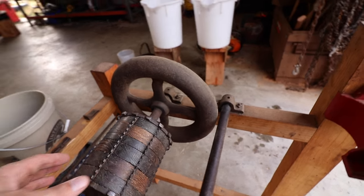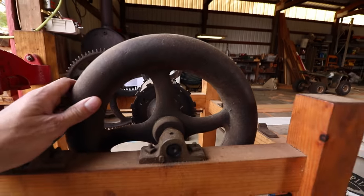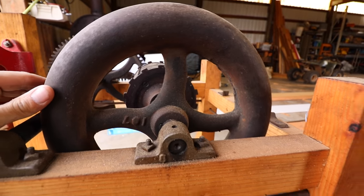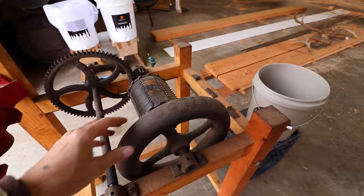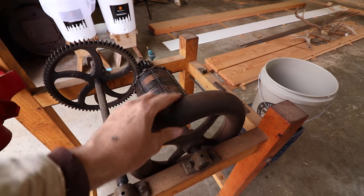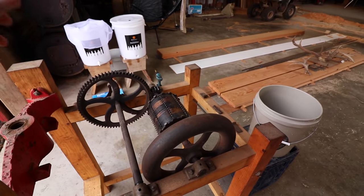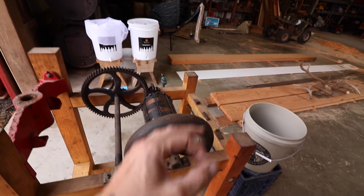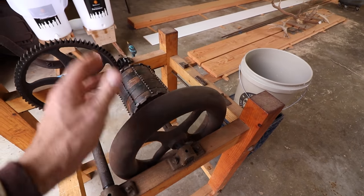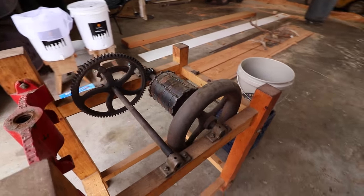One of the features that makes this really useful and easy to use is this heavy flywheel — and it is very heavy. The purpose of a flywheel, whether it's on a steam engine or cars or most any machinery, is that once you get a bunch of weight spinning, the mass of that flywheel will carry it through. So as you get it spinning and drop apples into it, that will help you keep it going. Having a heavy flywheel is so important when you're grinding a lot of apples. I've seen lesser mills that don't have them, and it makes for a lot more work.